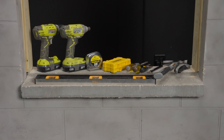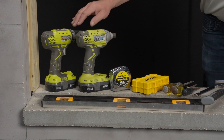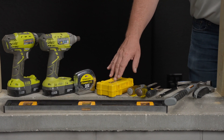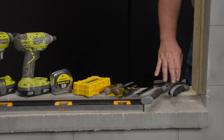Here are some of the suggested tools you'll need for this install: starting with the right size level, standard and impact screw guns, tape measure, different drill bits including a countersink bit, different size chisels, pencil, hammer, and razor knife.